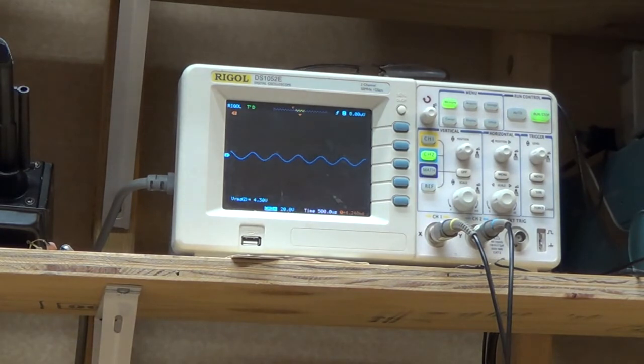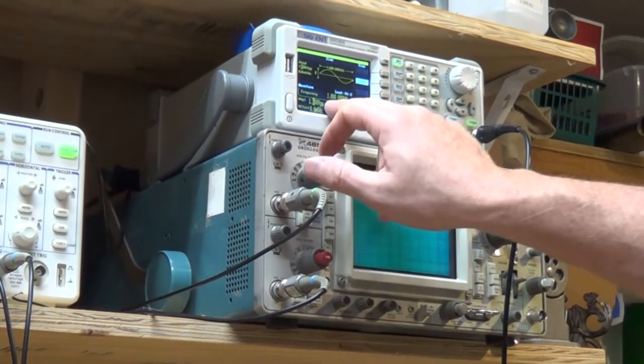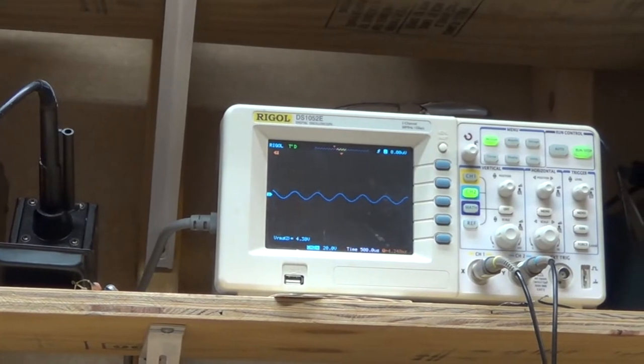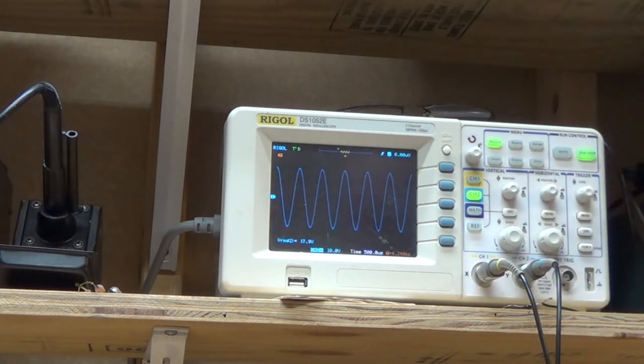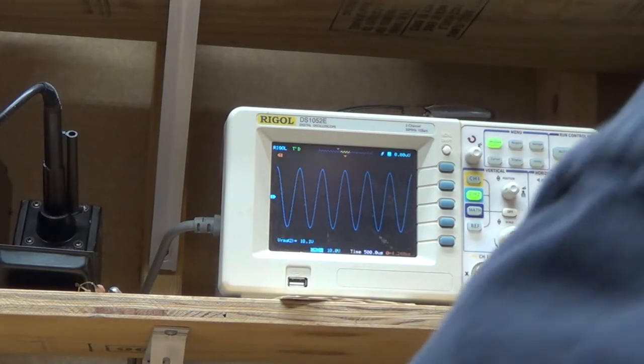Okay, so I'm just going to check out what we can do here. I've got a one kilohertz signal coming into our amp through the aux port, and I have our oscilloscope set up with RMS voltage here, and I'm running a signal through it into a big 8 ohm resistor. I'm going to turn it up until it starts to distort. It just starts to distort right in there. That's distorted, that's not. And so we've got about 18 volts RMS.